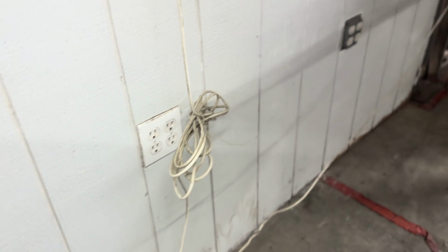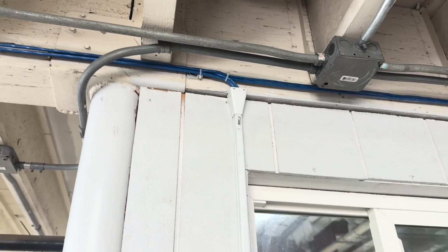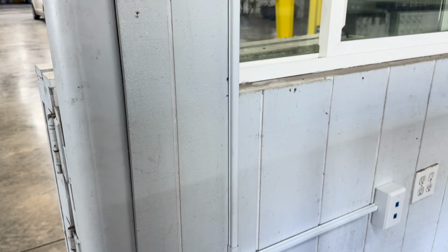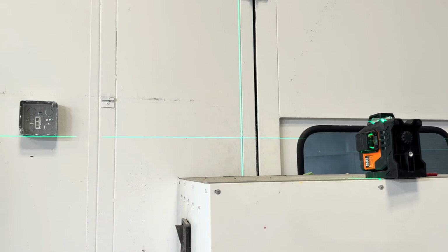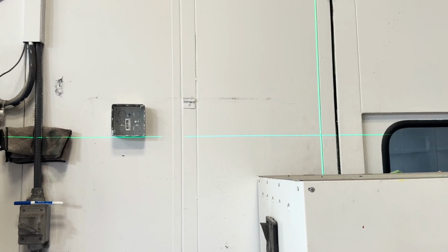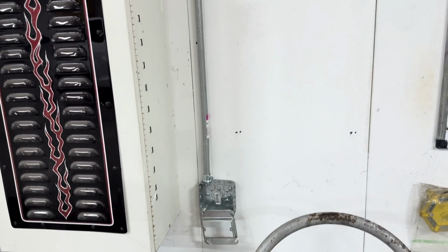When we dress our cables, we're trying to make them presentable to the end user. To that end, we get rid of all the loose slack and rolls and droops, and we put everything in hard conduit when we're able, and we make a proper information outlet for them. This way, they can plug their computers into something that's nice and sturdy, and if they should happen to bump or kick it in the course of their work, it'll hold up nicely.